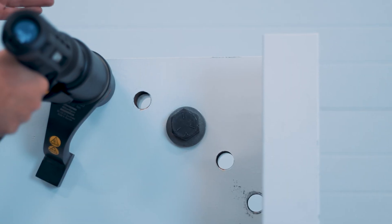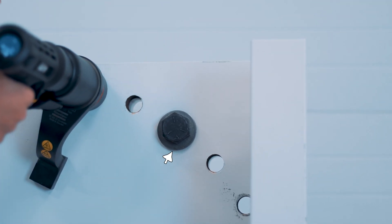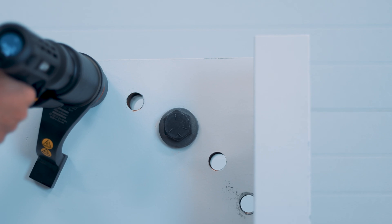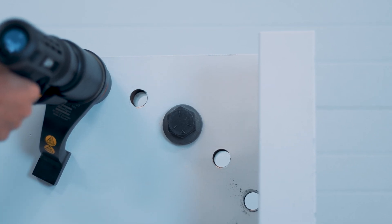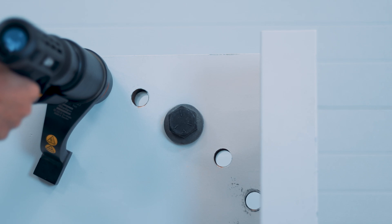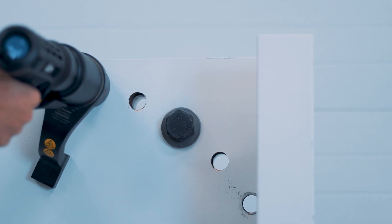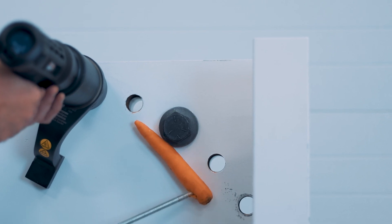Let's put on some safety glasses, tighten this bolt, and see what happens to our finger simulator. So my reaction bar is away from the joint right now. This reaction bar is going to swing over and make contact with this bolt in the opposite direction of the tightening, so it can react the forces caused by tightening this bolt. With a dual trigger we're going to make sure my fingers aren't in the way, but for right now we're going to engage our finger simulator. Let's go — engage finger simulator.